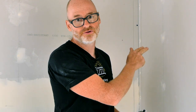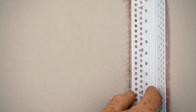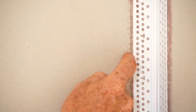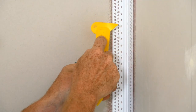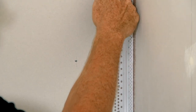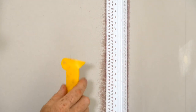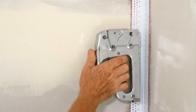Notice that this corner ended up just a little bit shy of the alignment mark — that was deliberate. I made the one and three-eighths inch batten slightly wider than the actual corner because it's always easier to follow an alignment mark you can see rather than one you've covered up. Once it's stuck and parallel with the alignment marks, use the tool from the kit to press it down firmly on both sides of the corner. Then wait four minutes and press it down one more time.